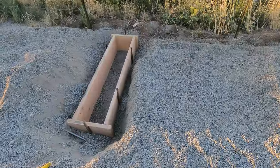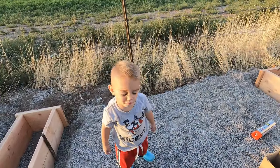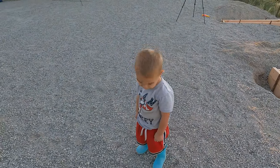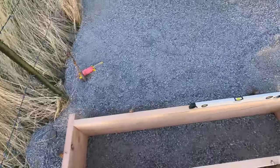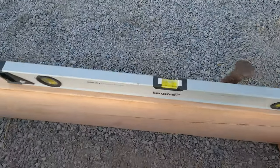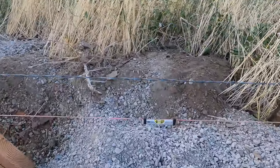I'm going to show you what I got done - it's taken me pretty much all day. I did get these formed up around a string line across the back. We got the dog helping us. I squared everything off that string and checked corner to corner to make sure they were all square. They're level this way and this way. It's probably part of the reason it took so long because I'm so anal about it, but I got it. They're all set, they're square, they're level.